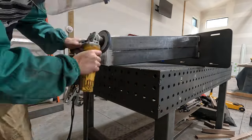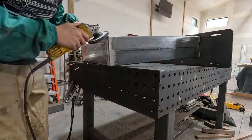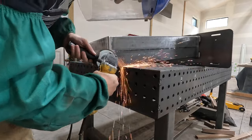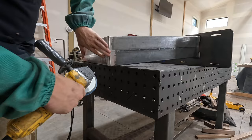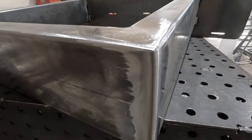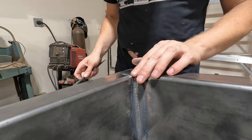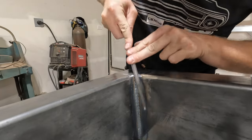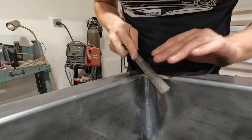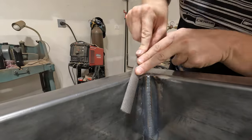One thing that will help you when you're grinding — go from one end of the weld to the other if you're able to. That allows the grinder and all your grind marks to basically even out the part so they're all the same and you're not making little gouges. When it comes to metal finishing, all your corners are important too. If your weld's kind of bulging out and sticking out, it's not going to look right once powder coat's on there. I'm a big fan of using files — they're a little tricky at first, sometimes you can make it worse rather than better, but once you figure out the technique that works for you, it's just money.